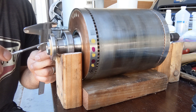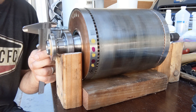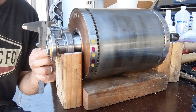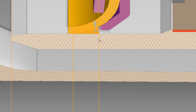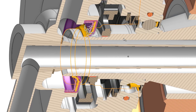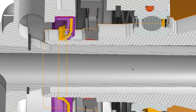We can measure the distance from the lip edge to this seal surface in the axial direction, and do the same for the excluder on this side. If you look closely you can see different reflective properties along the shaft — between here and here the shaft has been polished by contact with the old seal. We measure the distance between the shaft end and the start and end of that polished region. The polished region does not fully coincide with the seal, which could be due to measurement errors, thermal expansion of the shaft, or an assembly deviation.